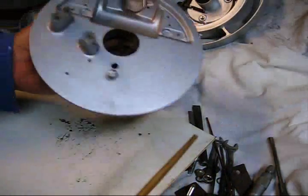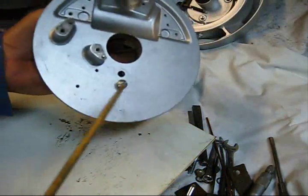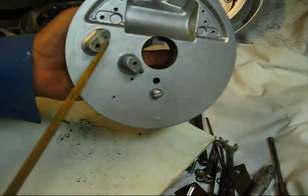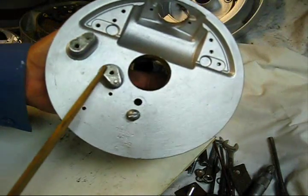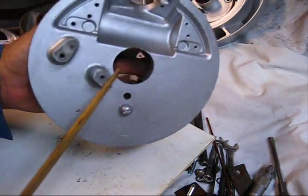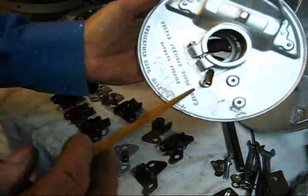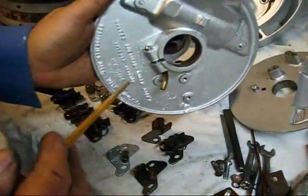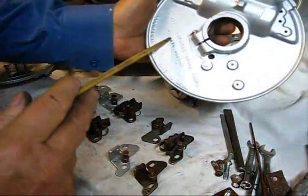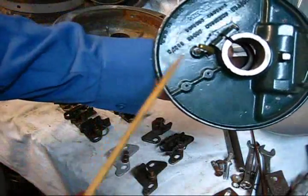But if you just have your engine on a static display where the engine sits there in the grass and runs idling all the time, then you need to change the point position. There is another version with an oblong base that's not drilled for the pins. We're talking about the Bosch magneto — don't be confused, this is not Eisemann, it's American Bosch, it's a FY ED4.